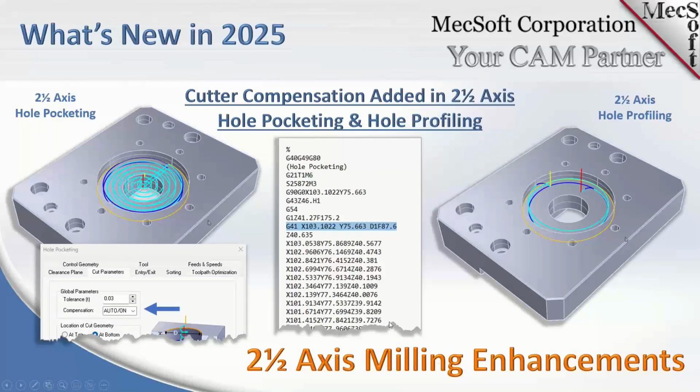Okay, so we're going to start with 2.5 axis milling. And the part that we see here, one of the main things we added is cutter compensation for hole pocketing and profiling.